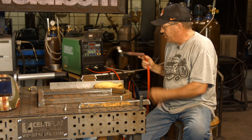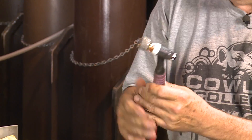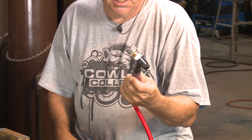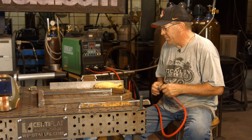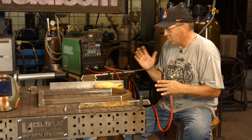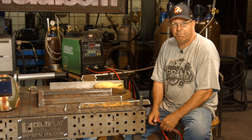I'm not going to do anything else to any of the other welds since it's just thin-wall tubing. The filler wire is 1/16th ER70S6. I'm running off an Everlast 200 DV with a 3/32 tungsten. Got a custom handle here from the cameraman. Non-critical application but a really cool project with a little math involved. The goal is to fit things up straight and square.